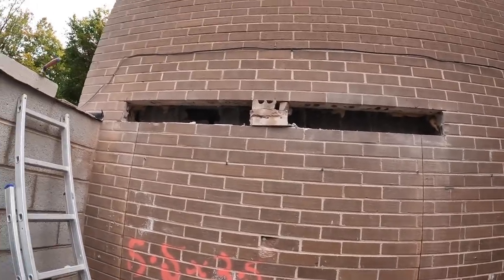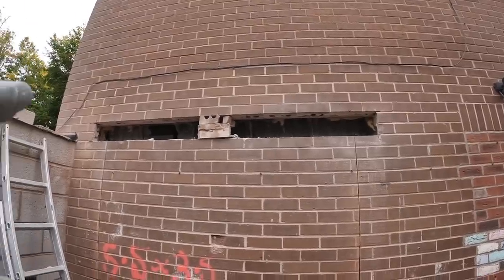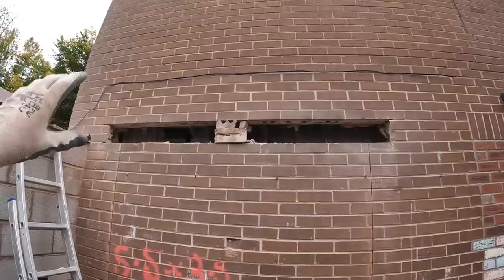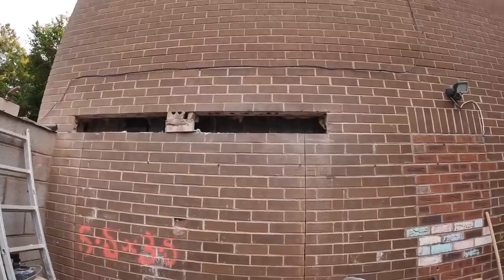But obviously it's bad practice to just open it up and put it on YouTube and have people thinking they can do it. It's all about experience and knowing what's here. Having taken all those others out, I know what kind of state this brickwork is in, and it's solid. We don't do sand and cement like that anymore. That's like 3-1. It's really hard stuff. Then the brick's like an engineering brick.